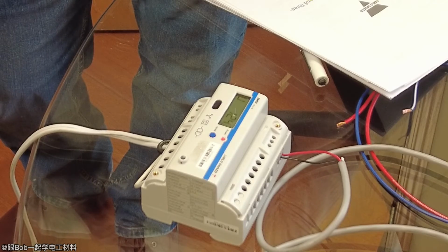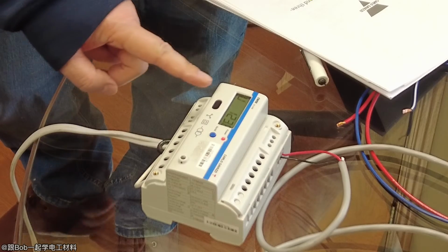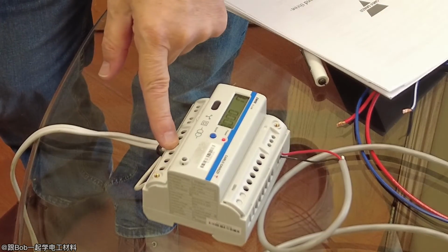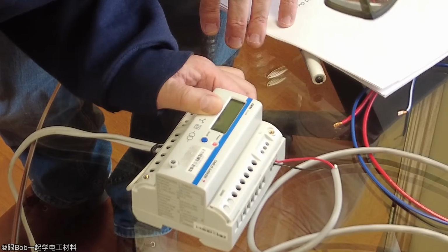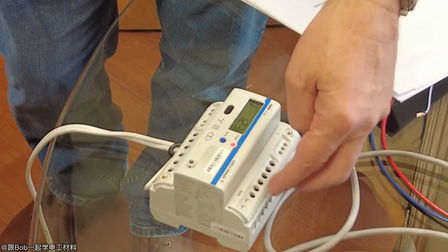Okay. These 2 wires just power up this machine. That's the power of that machine up. 120. Yep. This is 120. Yep. And I'm just jumping over to the monitor. So these are your voltage monitoring terminals. Yeah. Here's your CT inputs. 1, 2, 3. Okay. CT comes this way. Yep. Exactly. So you just wire the CTs into there.